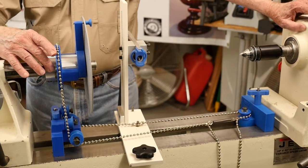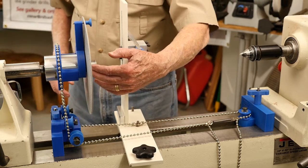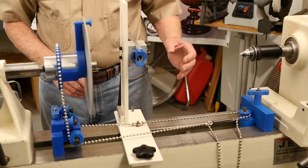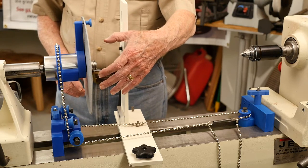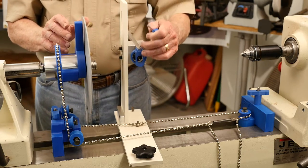On this end of the tool is a one-inch by eight threads-per-inch fitting to hold your chuck, which holds the piece you're turning. It's designed so that when the index pin is out, the two parts can move independently and you can advance your turning by the index wheel.